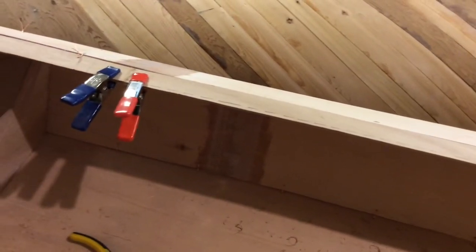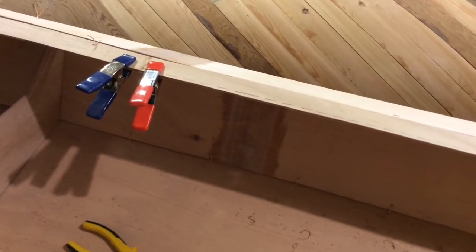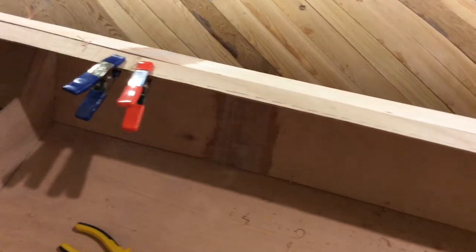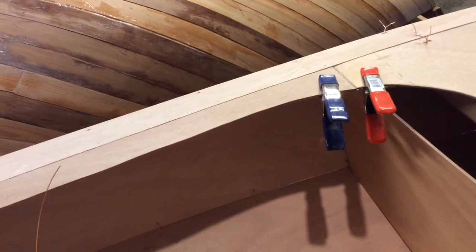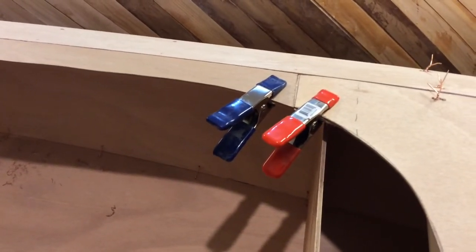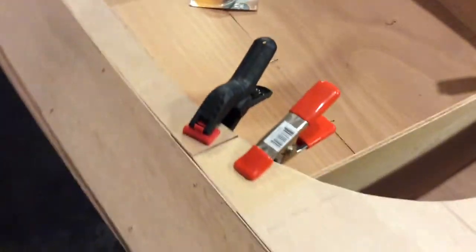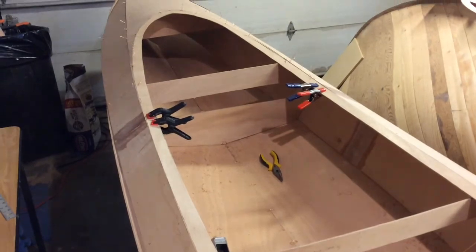I had to fair them into the shear panel, then laid them on top. I took a pencil underneath the existing rear deck and forward yoke and cut those out on the band saw. I've got a real nice tight fit, and then I've got little butt blocks - little pieces of plywood underneath there to glue those together. We've got them on both sides and a pretty nice fit.